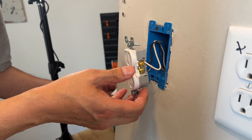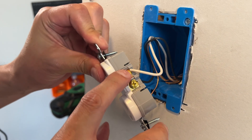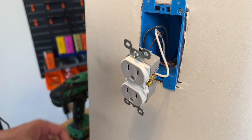This was one of the outlets marked as reverse polarity, and indeed we have the white neutral wire on the gold screw — that is backwards, a backwards-wired outlet. To correct it, it's simple: you're literally just going to swap these two positions.